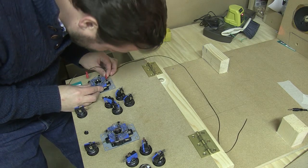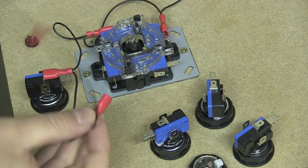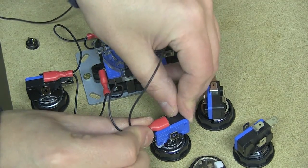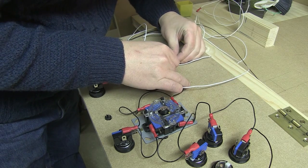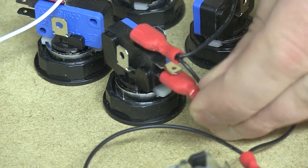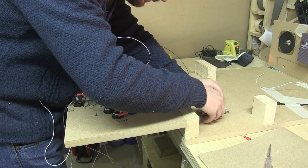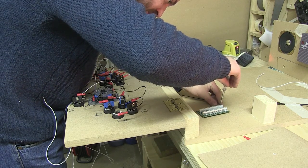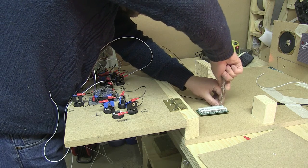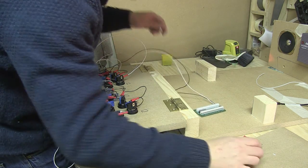Once the daisy chain is ready, it's time to connect it up to the earths — starting with the first earth and the first micro switch, working our way around logically from one earth to the next, daisy chaining them all together. Once I'd finished the earth, I wired that into the IPAC. I then started setting up each individual white cable for individual buttons — each white wire goes straight to the IPAC and into its corresponding slot. I actually did this wrong. There are two slots you could put the white wire into, and I picked the wrong one, and I felt the pain of that for quite a while.